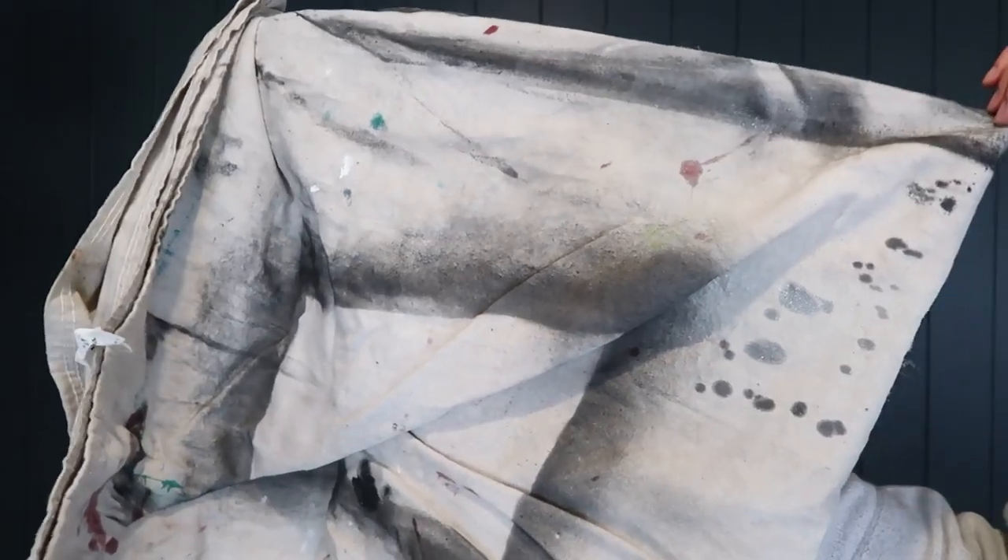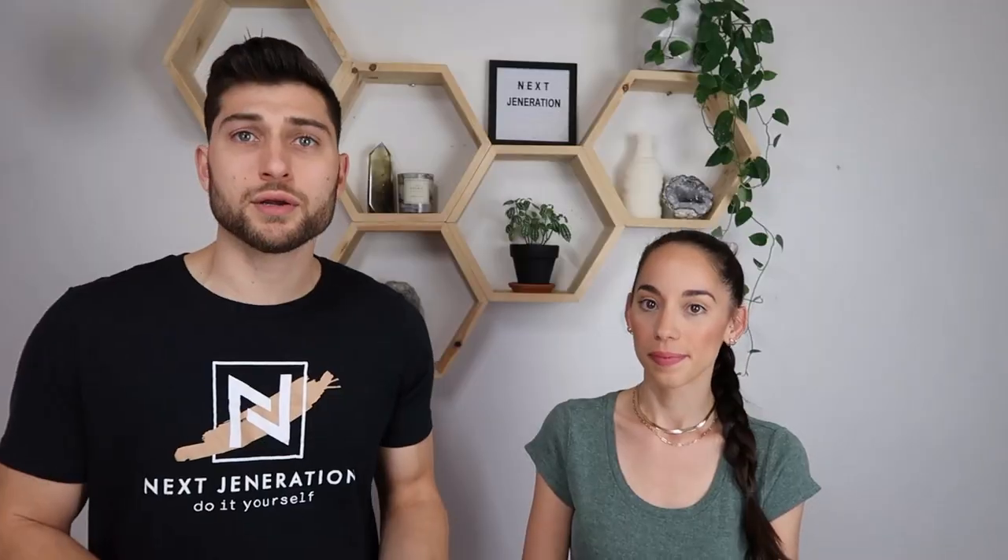As far as paint splatter and paint mess, we like to use a drop cloth — that way we don't have to go back with paint thinner and wipe up a million little splatters of paint. Once you've primed, we like to wait at least till the next day to add our paint just so that it's completely dry. Then we're going to add our beautiful new color to the wall — this is the exciting part. It's where it comes back to light.